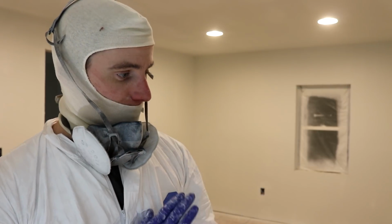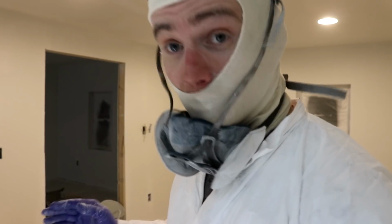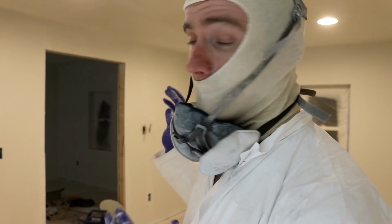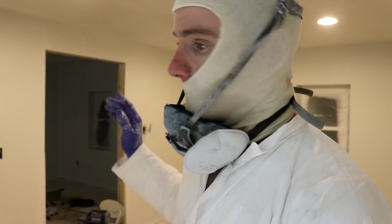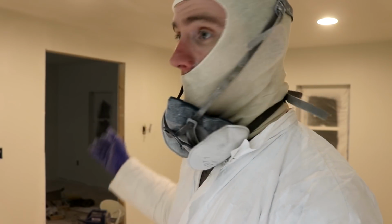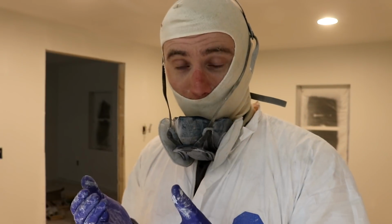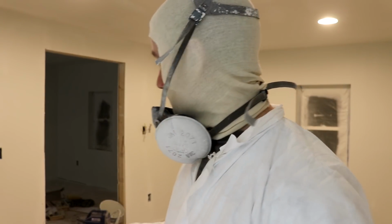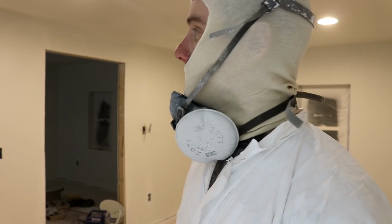I'm going to replace the front and the back door. I'm going to be trimming around doorways like this with some sort of simple trim, but since it's the only main doorway in the house without a door, I'll go ahead and trim that out. I didn't want to drywall around that like a window because I thought it might get banged up, people moving furniture around, just going through it all the time. So having a wood trim around that will be a little extra just to keep the corners in good condition.